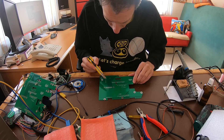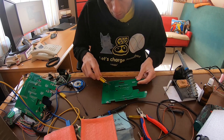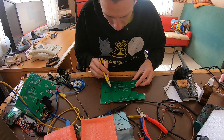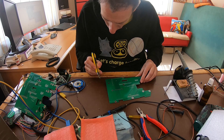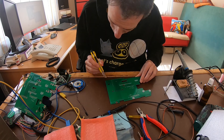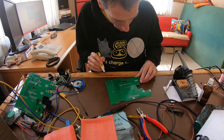Here we've got the connection to the DC-DC converter, and that's two-sided — top and bottom. This one plugs into the actual DC-DC board. And then here on top I can plug in the stock ZOE logic board and measure what voltage levels, PWM, or communication it passes down to the DC-DC converter, in order to hopefully replicate that. And here we've got the flat flex ribbon to the exciter inverter — it's an H-bridge. I didn't ring that out at all because it's kind of hard to do, so I will just be playing with it until it works, hopefully.